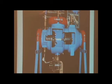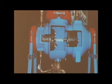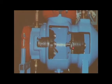And the check assembly, your first check here on the left, second check on the right, are held in. It's hard to tell, but I'll show you when we take it apart. There's a little clip that sits right here and goes right down the side of the body that holds that first check in place. It's a plastic piece that slips in there, and that's what holds the check into the body, this small little clip. On the second check, there are two spring clips, and here's the top clip, and there's the bottom clip that holds the second check in place.